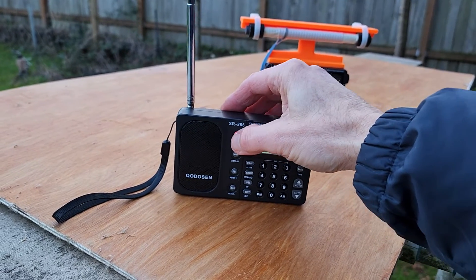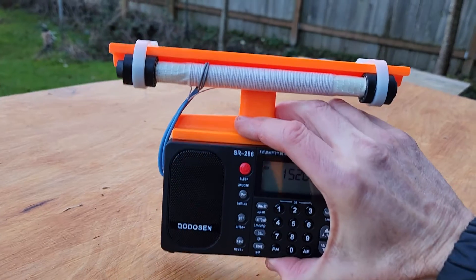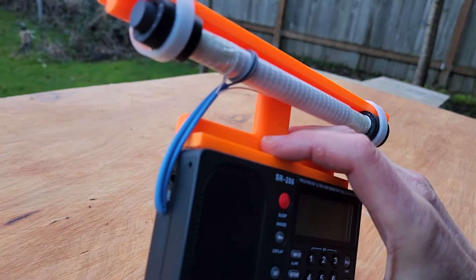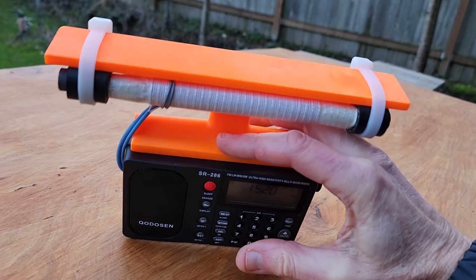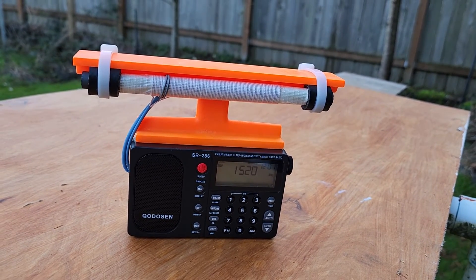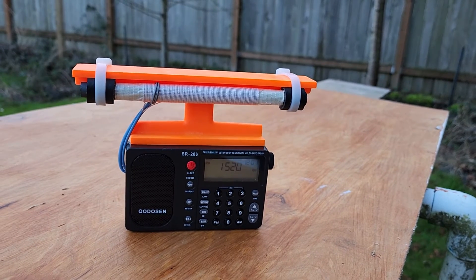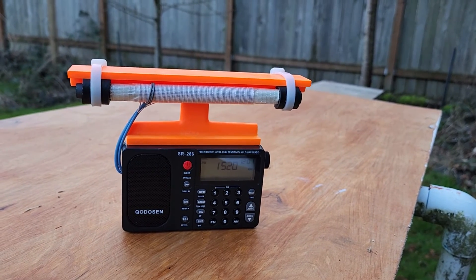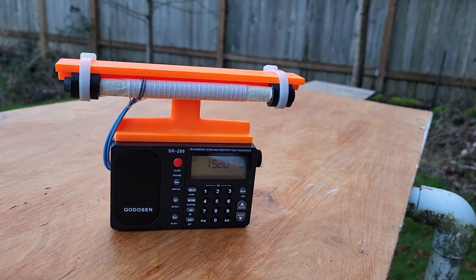Let me turn the stock one off and explain a little bit of the theory of this. This model has a transplanted 19-centimeter, 7.5-inch loopstick, which is a little bit technically tricky. It has a tickler coil, which you also need to run a separate lead in to attach it to the circuit board. But the entire modification, for someone with some technical experience, is quite easy to do. I'll provide the full details for anyone upon request. I did have to design a new loopstick here. This new loopstick will not work on XH-Data, Texan, or C-Crane models.